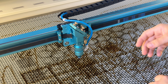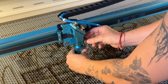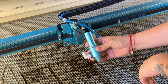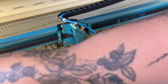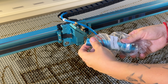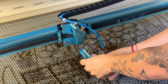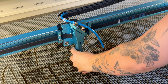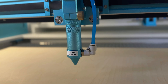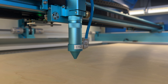Before I forget, we need to change out the laser lens. This laser comes with a standard two-inch laser lens, which is better for finer detail but not good for cutting thick material. What we're going to use for cutting our 12-millimeter plywood is this four-inch laser lens, which is great for cutting that thicker material. Quick tip: if you want to save yourself time or you're forgetful, put a label on your laser lens. Now we want to bring the laser bed up and set the focus.